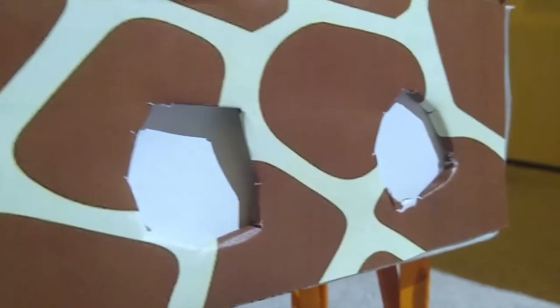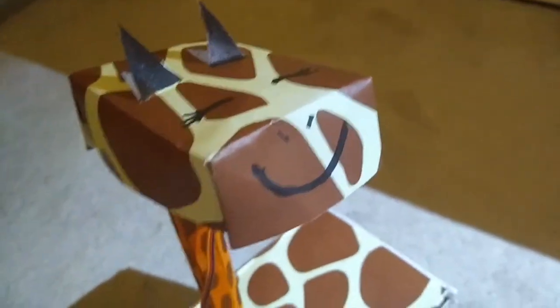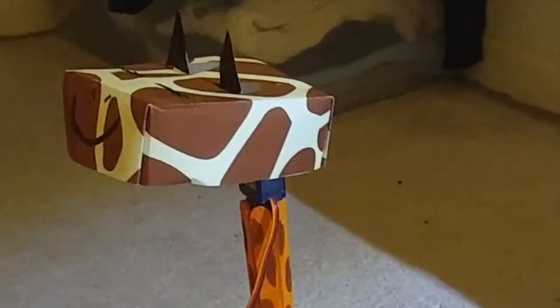One of them is for the right side, one of them is for the left side, and one of them is for the center. Every time a photoresistor would detect light past a certain intensity, it would give certain reactions. There'll be LEDs lighting up in the color corresponding to the direction, where red is right, blue is center, and green is left. A servo motor, which is the motor of this creation, would rotate its head in that direction that it detects the light in.